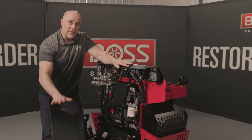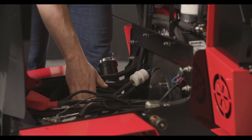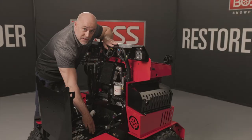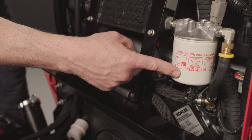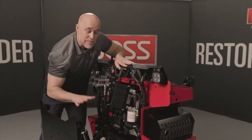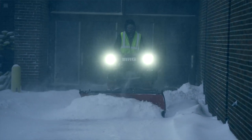Another really nice feature of this design is the serviceability and access you get to things you'll want to maintain on a regular basis. By taking off the front cover and lifting the hood, I have access to the fuel filter, the mega fuse, the four-gallon reservoir tank fill for the hydraulic system, and the hydraulic filter. All of this ease of access will make your service team more apt to perform regular maintenance.